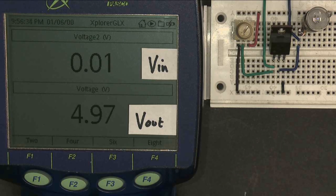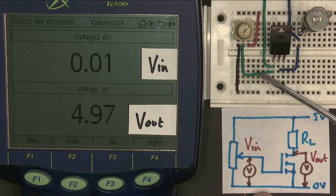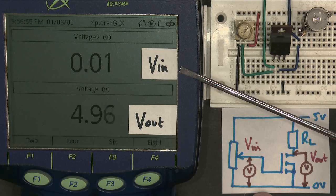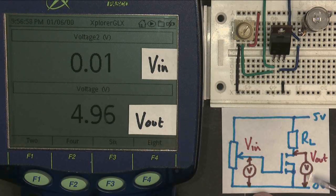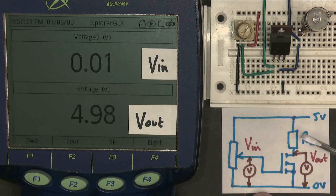This circuit looks at the transfer characteristics of a MOSFET, which is this device here. I've built this circuit to help us. We have a potentiometer, which provides a variable voltage to the gate, measured with a voltmeter as VIN. This green wire here is my voltmeter going off to the data logger. I have a MOSFET and I'm measuring Vout, the output voltage, with this blue wire going off to the data logger. And at the moment my load resistor, RL, is a light bulb.